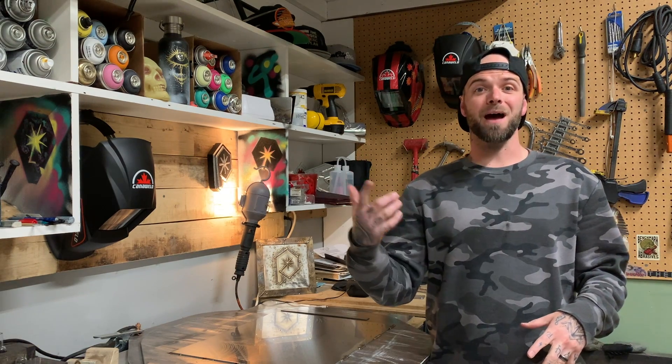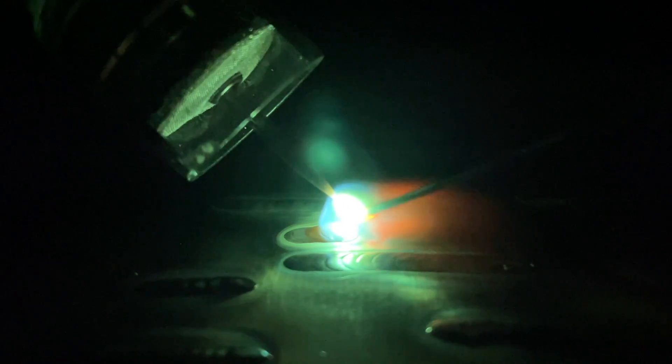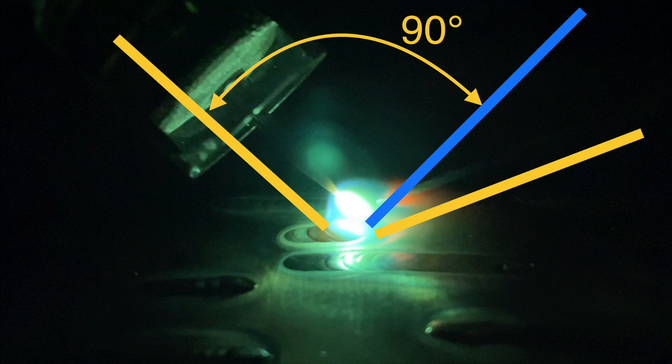Here's why it happens. One of the first things I see when I'm teaching someone, either in person or in my online training program, is bad filler rod angle. Bad filler rod angle is very common when first getting going with TIG welding. In this photo here, you can see I've highlighted a bad filler rod angle — the filler rod angle is too open. What I mean by open is it is not 90 degrees to the angle that the tungsten is at while you're welding.